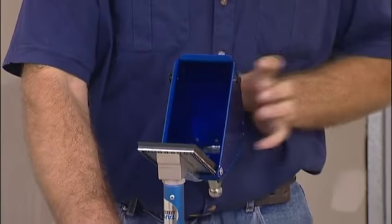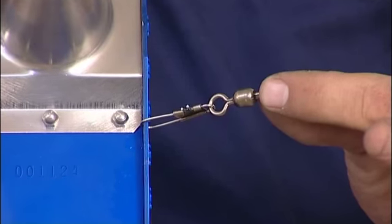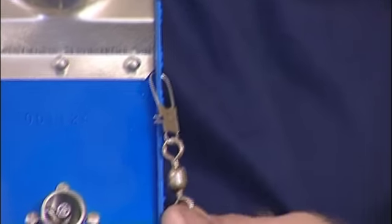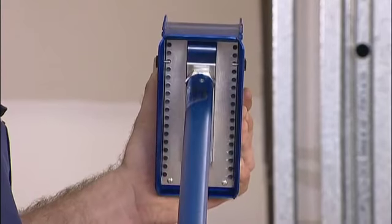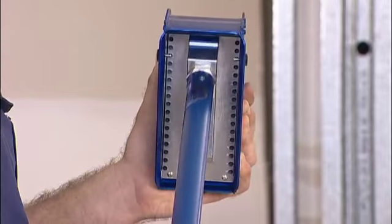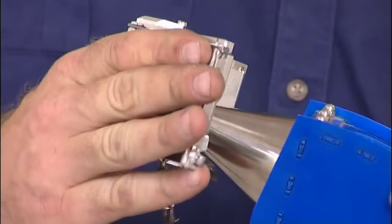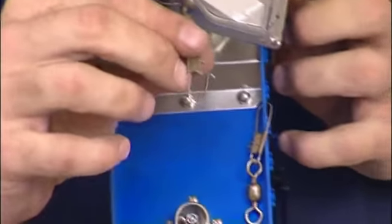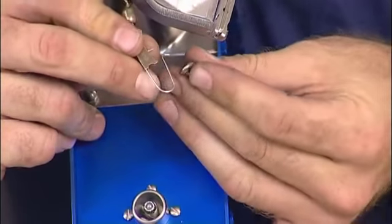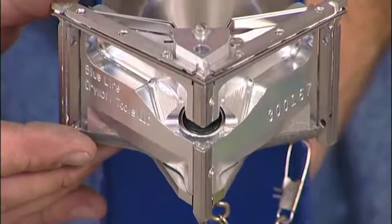The corner box has a swing lid, similar to the operation of the flat box, a clip for securing the corner finisher and a filler valve for use with the loading pump. Before use, check that the lid moves freely. Attach the corner finisher by clipping it onto the nozzle of the corner box. To ensure that the finisher does not fall to the ground if unclipped by a nail or other obstruction on the wall, secure the finisher to the corner box. The ball socket enables a range of movement.